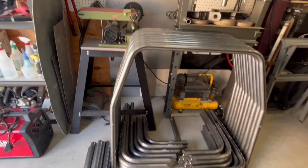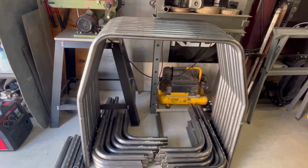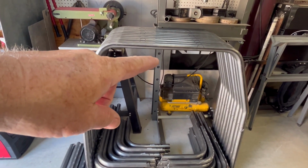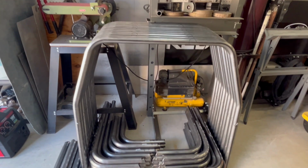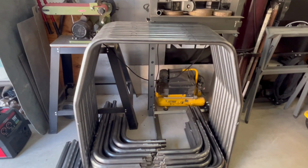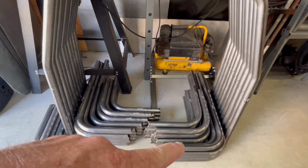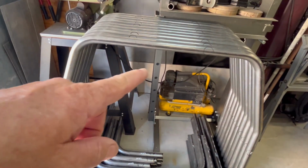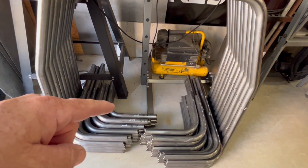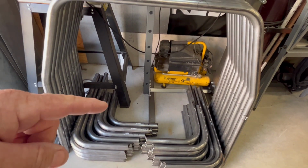Once you receive your Baja Bumper knockdown kit, it's going to comprise a few things. We've got the main engine hoop here, which we will split in the center for shipping. We will provide a sleeve that'll go in between right here, and you can get it all welded back up. It's going to have a driver's side and passenger side down tube, which will go directly from the center of the cage here and go underneath the motor. It'll have a driver's side and passenger side tube, which will start from the side and come over.